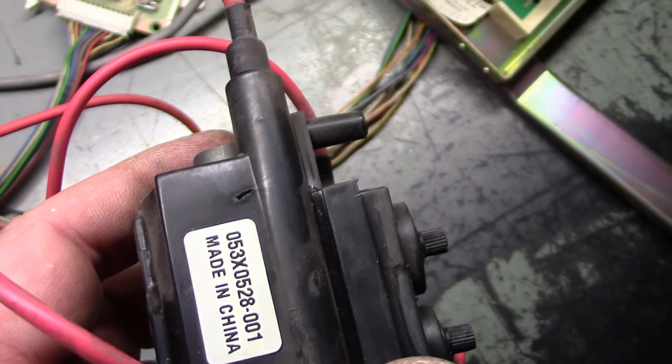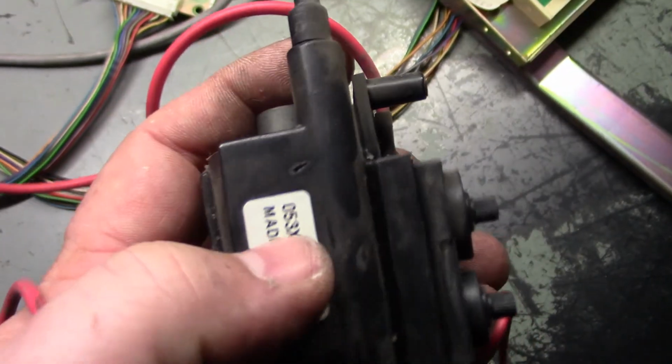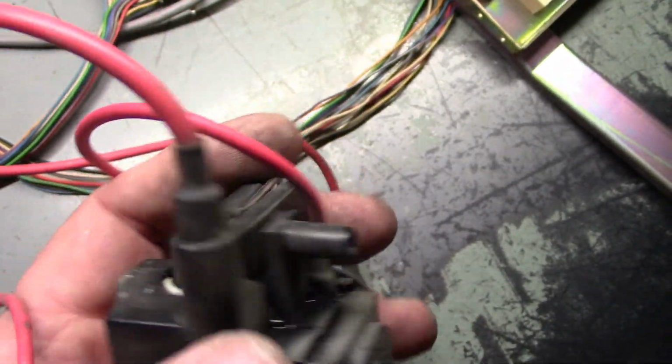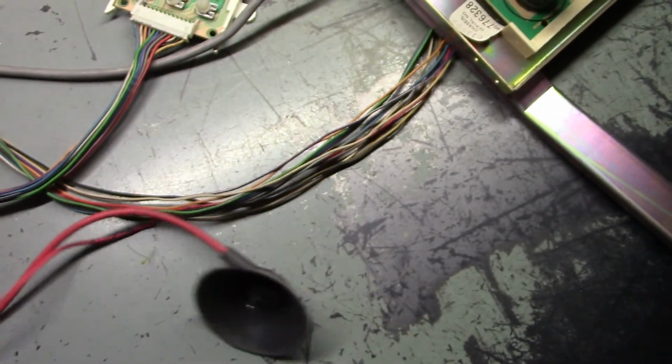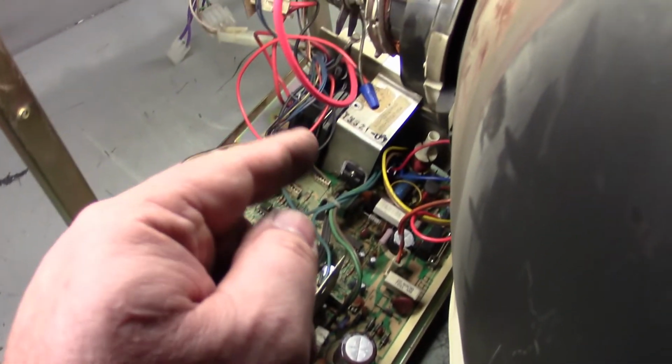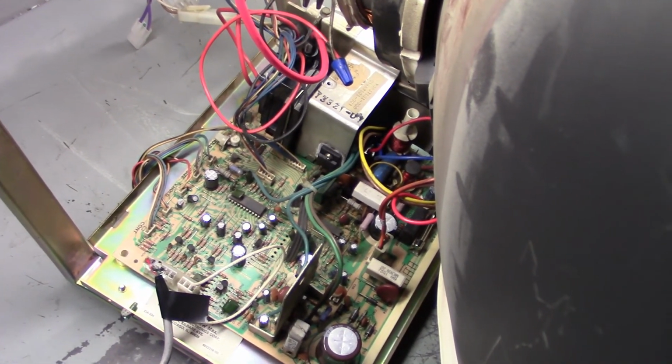Yep, that's a goner. I could have patched that, and this probably could have lived a little bit longer, but the voltage would have just found another way out somewhere else. So the Flyback decided to open up and arc itself to the frame, which has a little bit of oxidation on it where it was obviously arcing for quite a while.